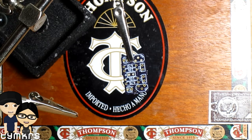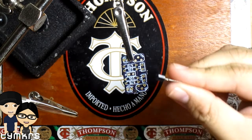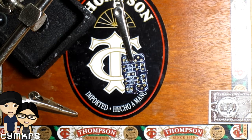The red seems a little dim, but I'll show you guys how I'm determining polarity when I solder it in. Usually I go from left to right, and I think I'll leave the LEDs for last, but we'll at least put the NPN transistors and then the 470 and the 10K and the capacitors. With this one you just follow the silk screen. Here's your NPN transistor. I'm just going to bend one of the legs here just a little bit.